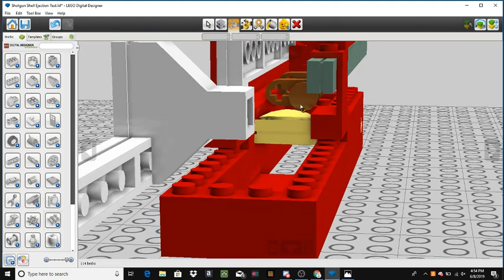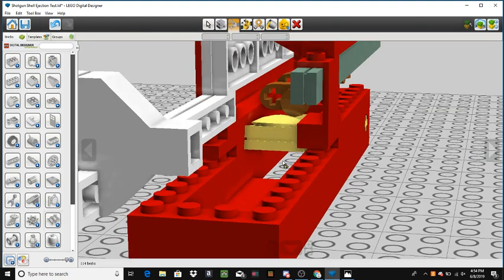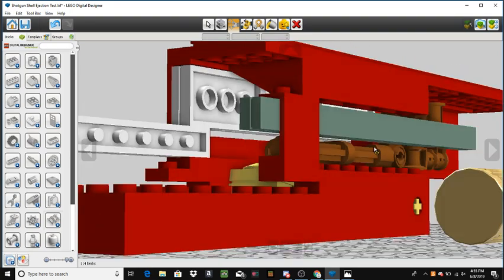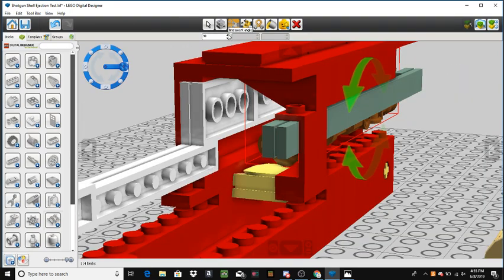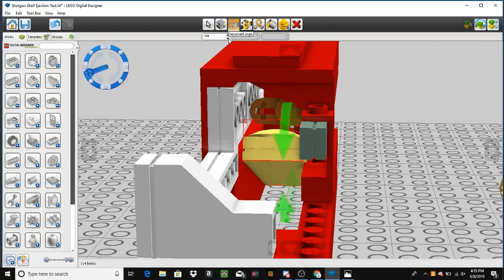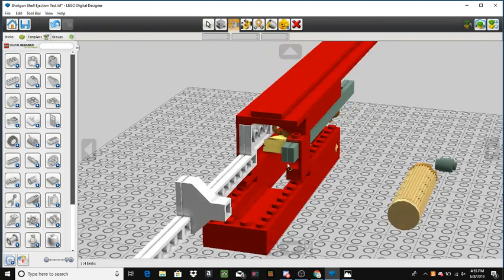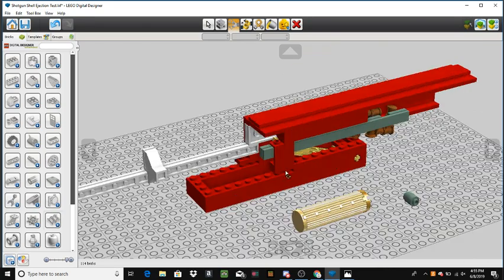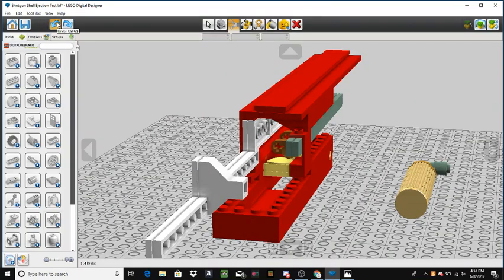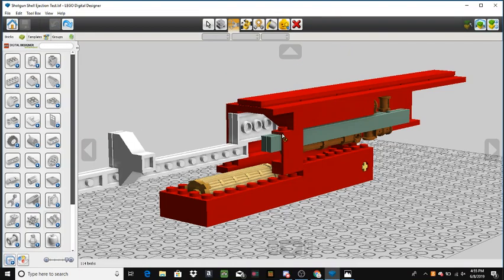Eventually this is going to hit the ejector, which is the brown part. You can see that there's not enough clearance here for our shell to load. So in tandem, both of these are going to move together. This is going to rotate upwards, like so, and this is going to follow it upwards, like so, until it stops. Clearly, this is plenty of space to load this shotgun shell and many more down the tube as you would need to. So that's the first function of this out of the way.